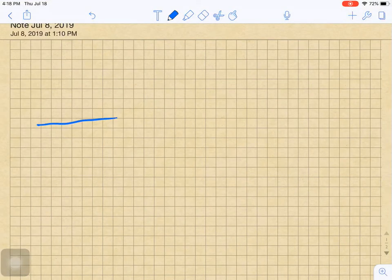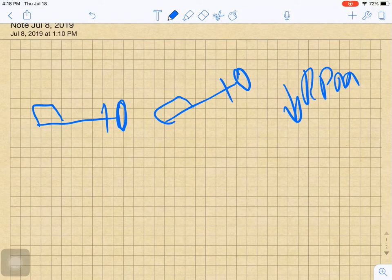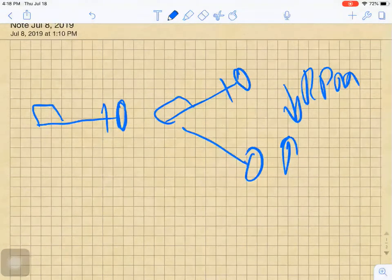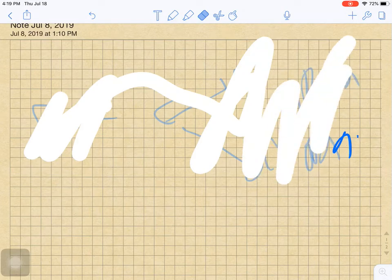So why do we call it a constant speed prop? Let's say you're in level flight, and your RPM is the same. In a single engine aircraft, if you start your climb, your RPM decreases, right? RPM goes down, and if you descend, your RPM goes higher. But in a constant speed propeller, the governor will keep it constant. How does it keep it constant?